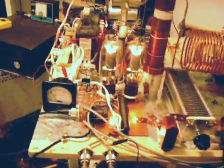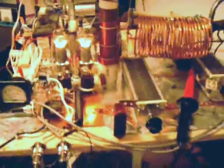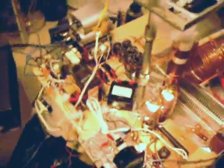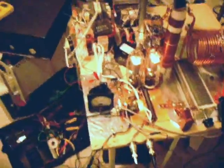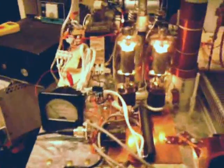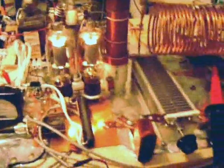So this is the homemade linear by KD5MHQ. It's dangerous as hell, but I just know what not to touch and what to touch. There it is — the 550-watt linear using 572B tubes in a grounded-grid linear configuration. That makes sense.